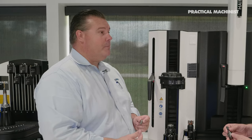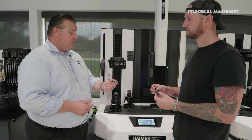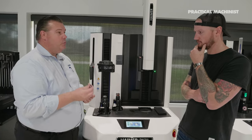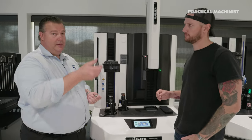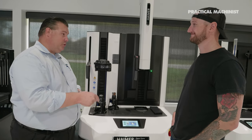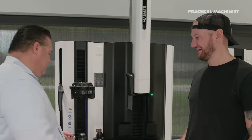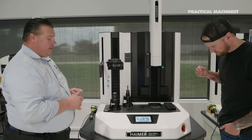With the shrink collet, you heat up the collet, it expands, you put the cutting tool in — you get much higher gripping torque and better runout accuracy. The real key is that in a live tool you can change out one preset, pre-shrunk cutting tool in a shrink collet in about one minute. It takes all the tool setting out of it. Traditionally you'd open up a collet nut, clean everything, put the new cutting tool in, preset with a caliper, cut the part, scrap the part, measure, adjust your offset — you could be down for 15 minutes. This turns everything into quick change.